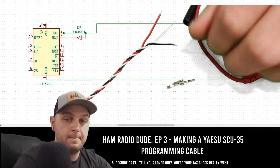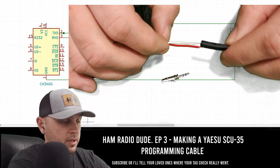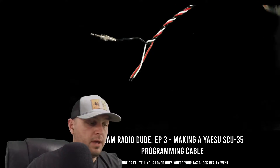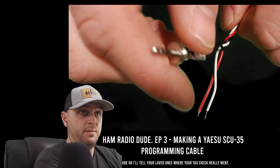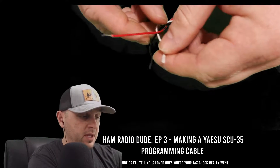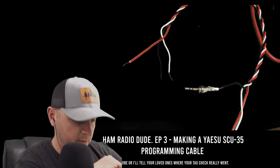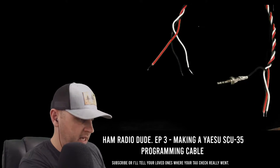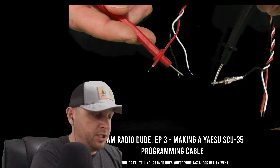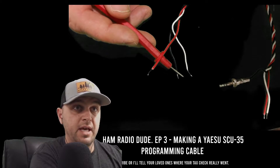We now have the ground soldered in — the black wire is on the bottom terminal. I'll check continuity: using the female disconnects, I want to make sure we're getting continuity from the bottom portion of the male prong to the black cable. That confirms ground is correctly soldered. I also check the other terminals to make sure I haven't accidentally soldered anything I wasn't supposed to on the stereo jack.